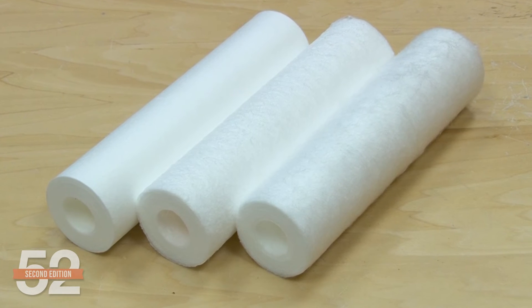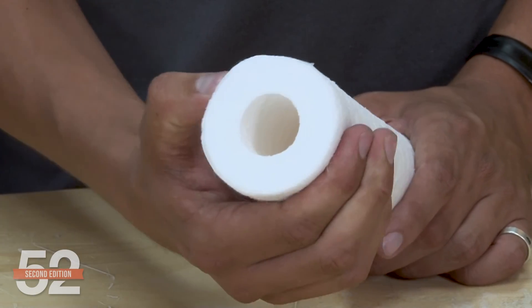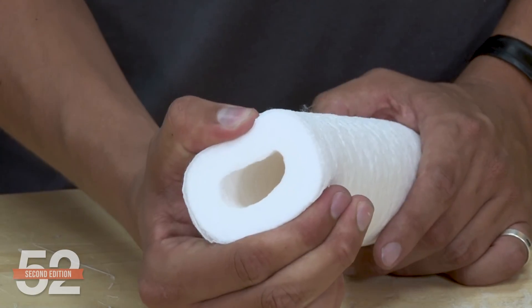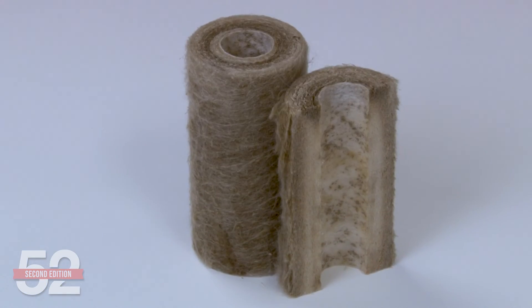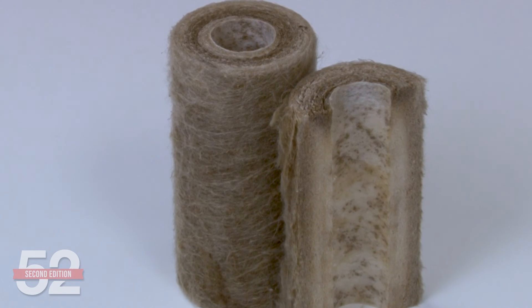Alternatively, you can use a better sediment filter. Every sediment filter these days calls itself a depth sediment filter, meaning it's looser micron on the outside and gets tighter towards the center. However, they don't all perform that task the same — some do it in two or three steps or a small range. We use ROSave.Z filters here because they have a true graded density. You can feel the density difference in your hand because the outside is softer and the center is denser, and it will last substantially longer. We cut one in half so you can see how it collects various degrees of dirt and sediment throughout the entire thickness of the filter. While ROSave.Z filters do cost a few bucks more, they can often last more than twice as long, making them both the most cost effective and less work.